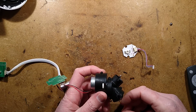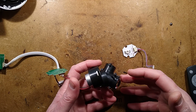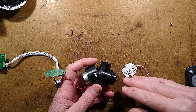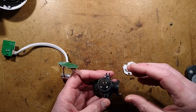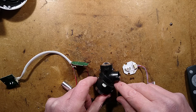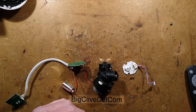In summary: quite a disappointing fault - the cable had basically condemned the whole product. But it's interesting to take apart and very different from the other one, despite looking identical externally. The circuit boards are different; it's using a regulated power supply to lower dissipation, which is a better approach. The optical assembly is actually more complex, requiring a mirrored rotating rippled disc, but it just doesn't pack out as much light. Shooting the laser into the optical assembly gave good results, but overall it needed just a new cable - an easy fix, though the performance is a bit disappointing compared to the other unit.